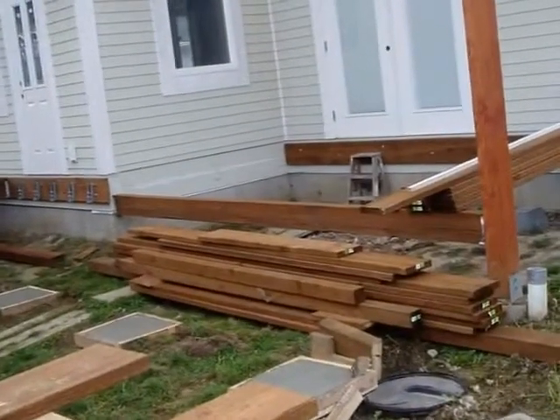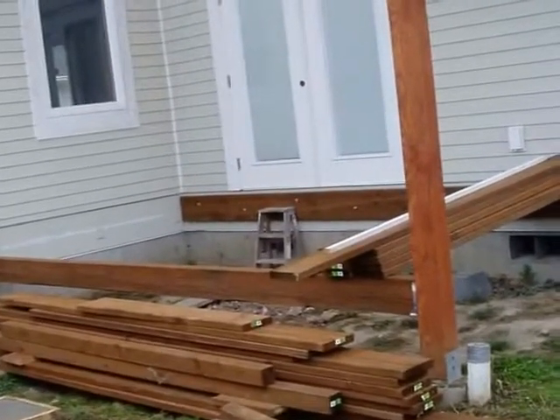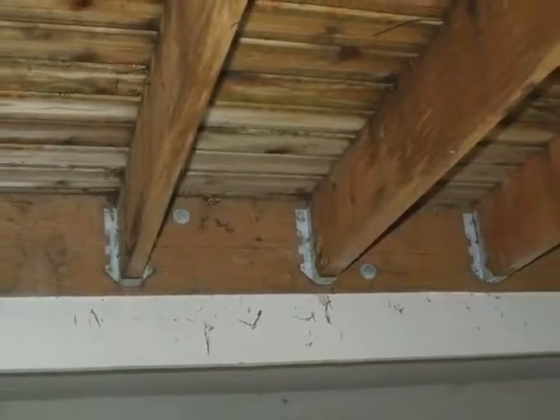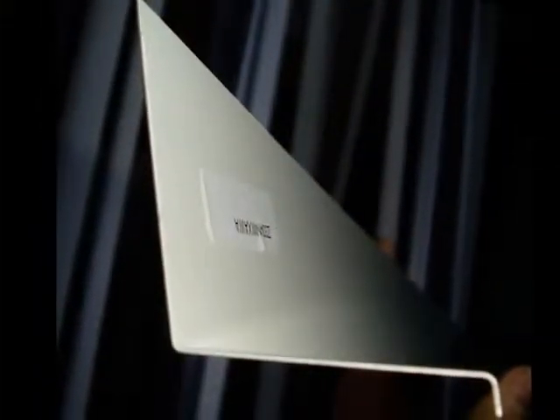At the time of repair or construction of a deck, balcony, or porch, good design calls for lag screws — or another alternative, through bolts with accompanying nuts — at the ledger board, and a suitable flashing, usually a metal L flashing, to protect against moisture seepage into the exterior wall of the home.